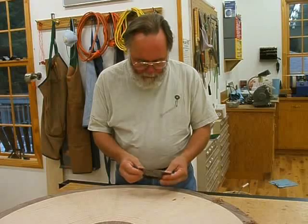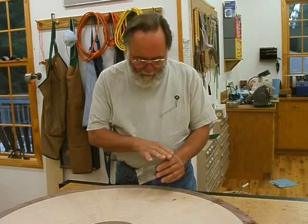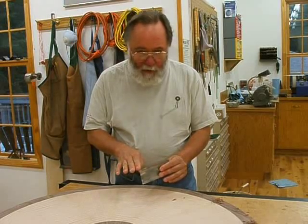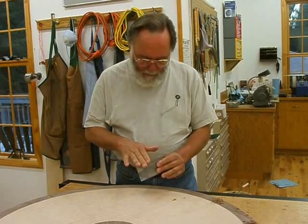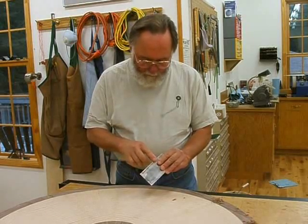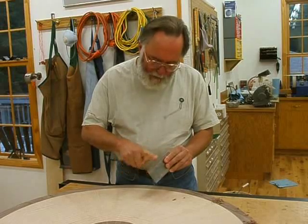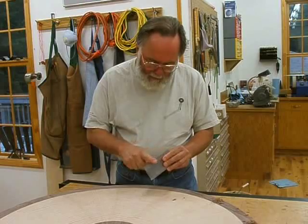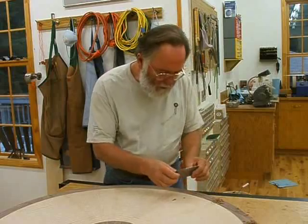This is a piece of thin steel. I've flattened the edge and then using a burnisher, which is really just a steel rod, I've actually pushed over the edge slightly to give a burr. What you do is you run the rod down the edge pushing hard — this is in a vise — pushing hard down, and it causes a burr to form.